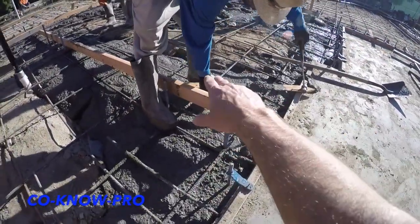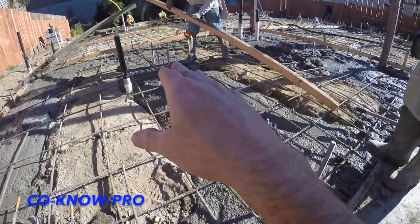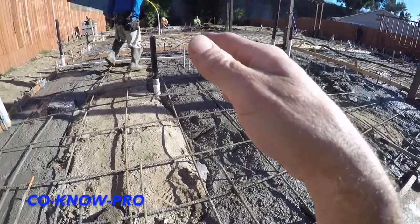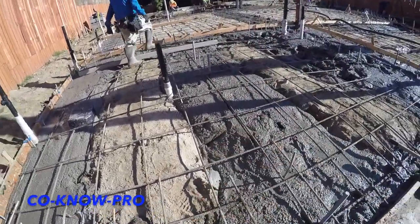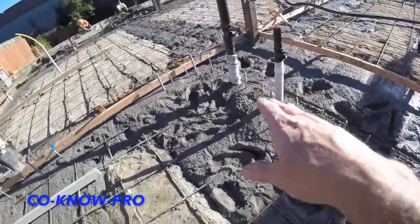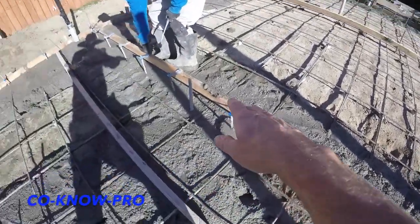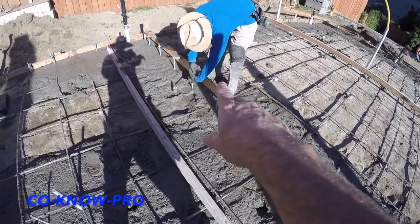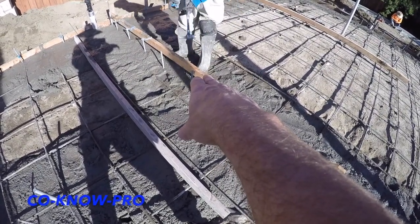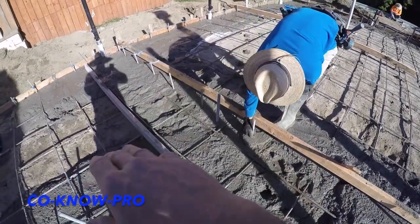You see how he's taking out the form right now — taking out those stakes and that temporary two-by-four. The main reason that two-by-four was there was to hold the hold downs. After the concrete got poured, they basically just took off their hangers and set the hold down right in front of where the mark was, left the hold down in place, removed the hanger, and then removed the board — so your hold downs remain in the same place. He's going to remove those hangers, set the hold down right in front of it, and then when done he'll remove that little board. Then they'll pour all the rest of the slab on grade up to those hold downs.